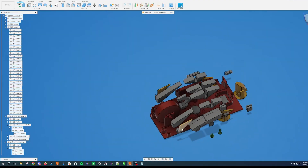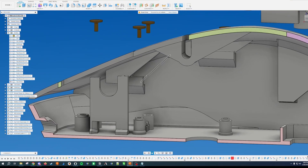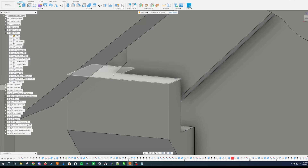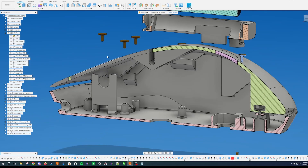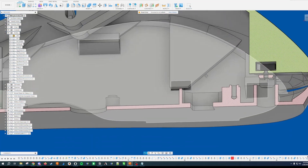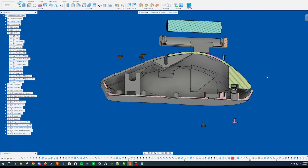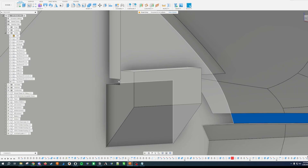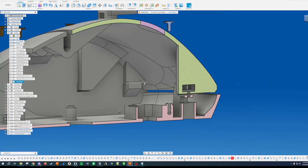I use very light back hinges and front lineups — essentially they slot into the front. There's an overlap gap that is intentional; it's a 3D printing tolerance thing. In the back it's a bit looser but still has some overlap by design. I have some areas in the back for it to push down on and have resistance, so that even though there's a screw post, it's just a little extra support.